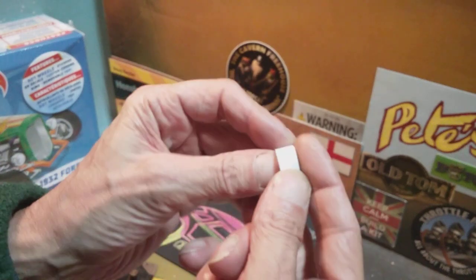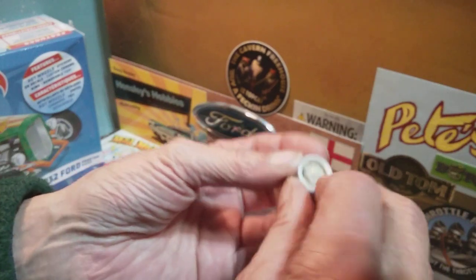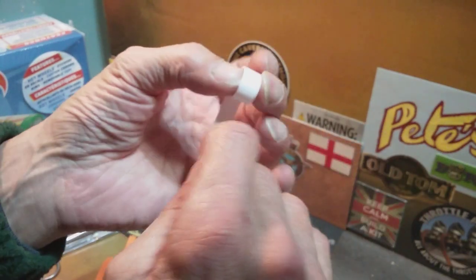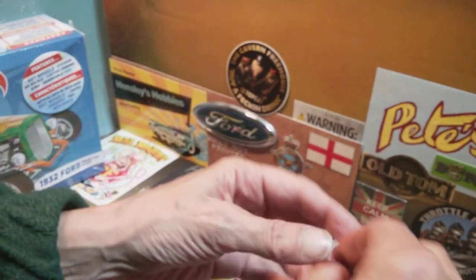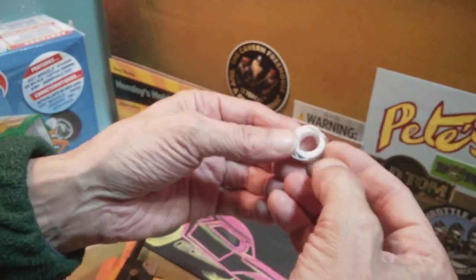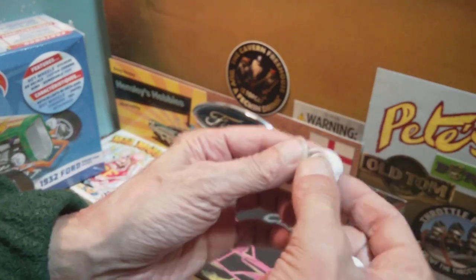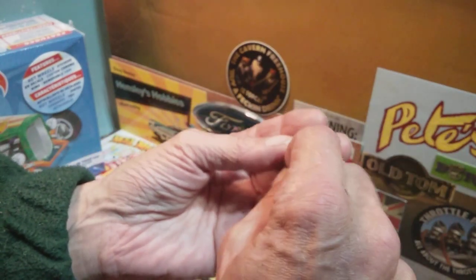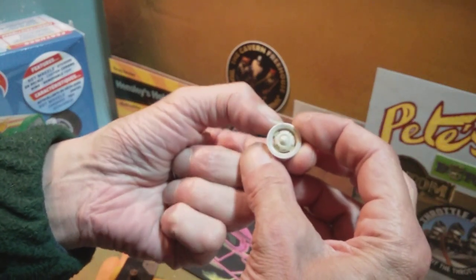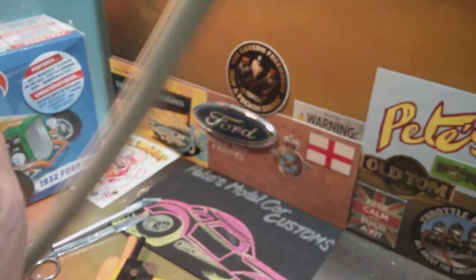The process of putting this band on — I don't know if any of you know about heat treating styrene strip with boiling water to get it to stay in a coil. So I've got a coil of banded styrene, from which I use the centre. That's the outer offcut, which I may still need. The reason I start in the centre when banding is because of the smaller radius — the radius of this coil will increase as it radiates out from the centre, it can't help it.